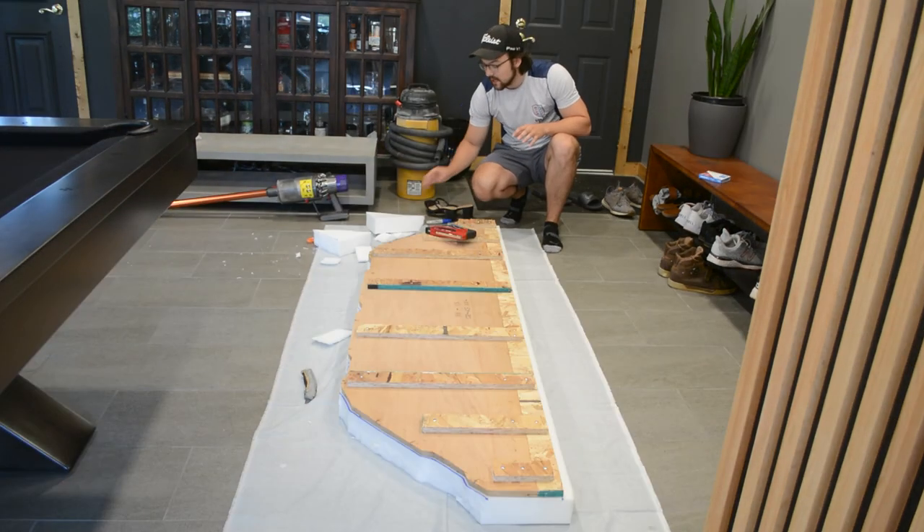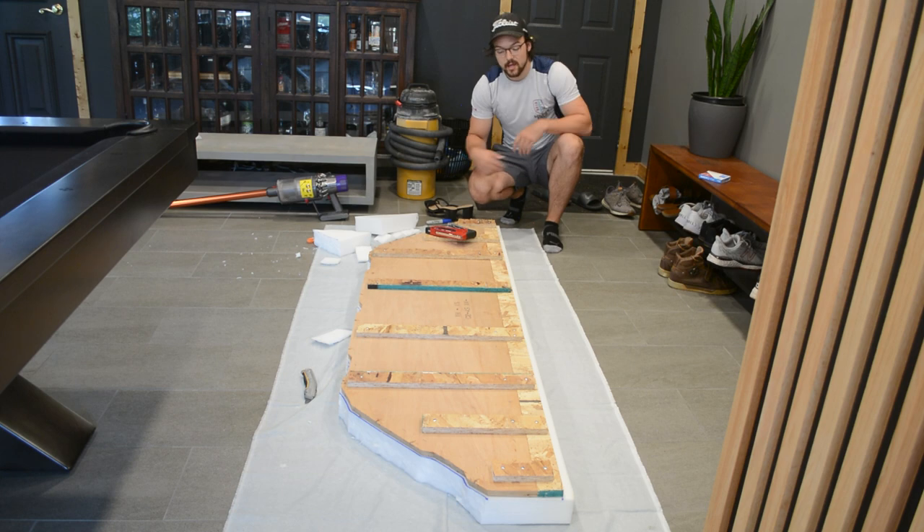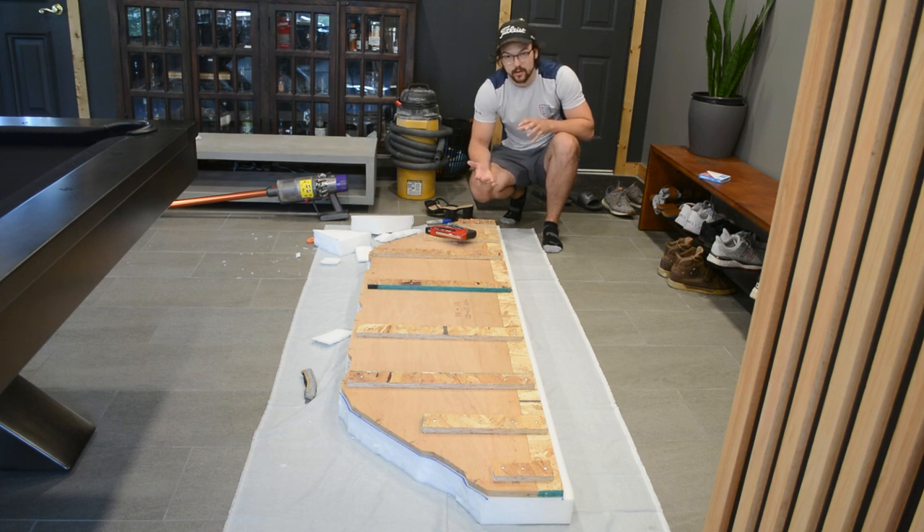We now have all the foam cut out and I actually didn't have that many leftovers, so we had just enough. I also left about an inch of overhang on the front on purpose so that when I wrapped the fabric around, the front edge is nicely covered with a little bit of foam so that the back of your knee doesn't get caught underneath this wood. Normally upholstery like this is done with a pneumatic staple gun hooked up to an air compressor, but I just have a manual stapler, so I'll be using that to staple everything. I'm going to start in the middle and work my way to the edges, pulling it as taut as I can as I go.